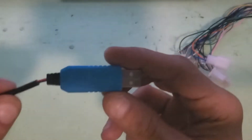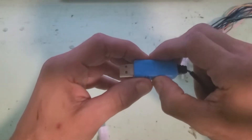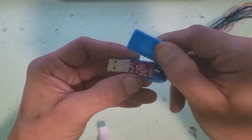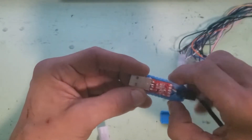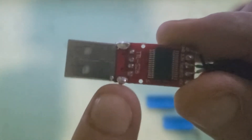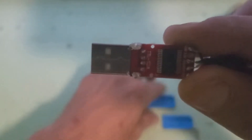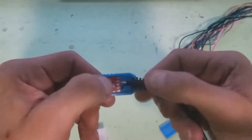Okay, so just a couple things to check before you plug it in. I had this problem with mine. If you open it up and look inside here, right on the outside of the USB where the ground posts go in, it wasn't soldered at all. So right here on these two points, it had ripped out of the board and almost pulled all the pins right out. So just want to check that and re-solder it if it needs it. Just touch it back up and then put it back in its case.